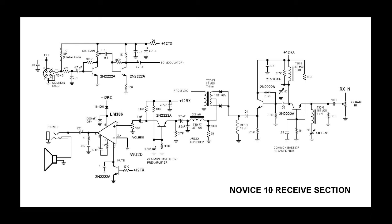The single balanced demodulator is almost identical to the modulator circuit, but I did leave off the 100 or 200 ohm balancing pot. The detector actually would benefit from having that pot included, but I didn't think it was necessary as long as I had the diodes fairly well matched. But remember, balance is always beneficial, even on receive. The post-detection termination diplexer and filtering system, it's adequate, but there's another place where we could make great improvements and sharpen the audio response just for speech frequencies.